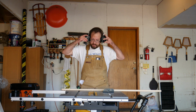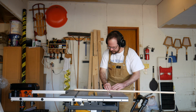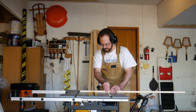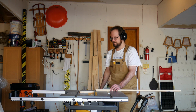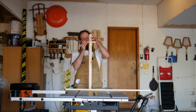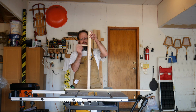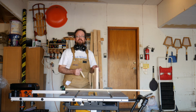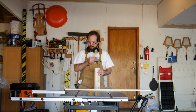And we'll just cut that off. Now here's our height adjusting dowel. It'll just fit through one of these 3 pieces, or none of those pieces, and that will give us 4 different height adjustments. Now for the top of the gallows, it's basically an L shape and then a brace.